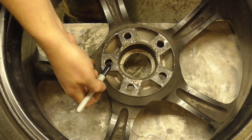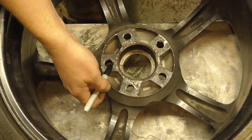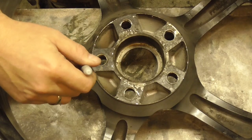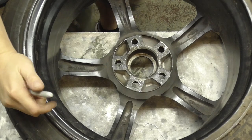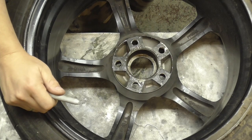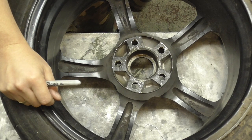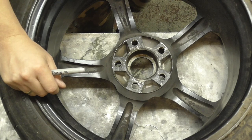I've noticed these were actually sold to me as Volkswagen 5x112 wheels, and at some point somebody fitted them on a T25 because I've got a picture of it. As a consequence there's actually a slight amount of damage on the insides of the bolt holes, which makes getting an accurate measurement on the inside lip slightly tricky. It's slightly annoying because they aren't the 112 Volkswagen wheels they were supposed to be, but at least now I know what they are and I can sell them accurately without any misfitment issues. Hopefully this video will help you guys measure your wheels accurately with PCDs so you don't fall into the same pitfalls and traps I nearly did.